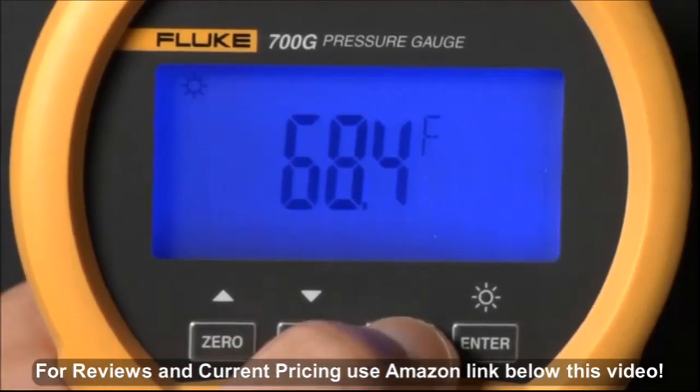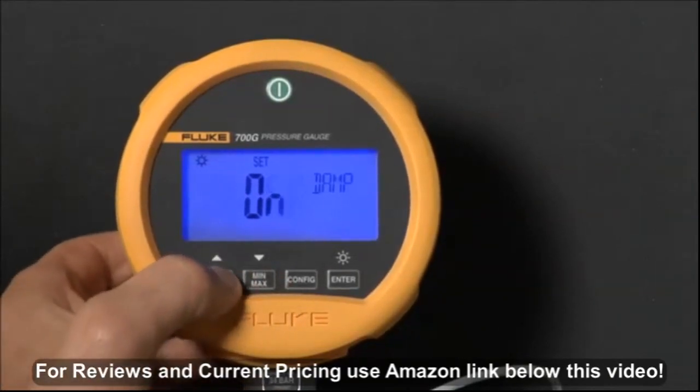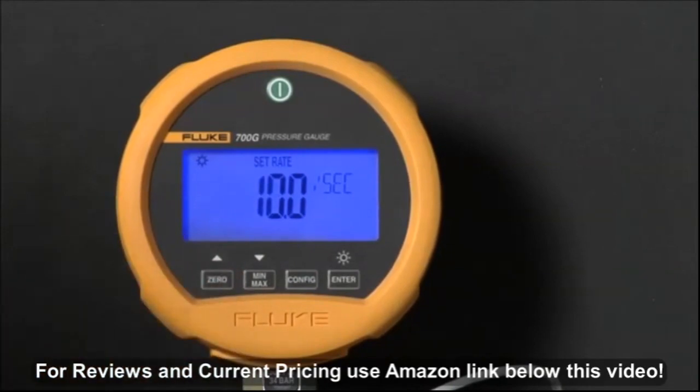Press Config again to see the dampening setting. Dampening smooths or averages readings from pulsating pressure sources. Up and down arrows turn dampening on or off. Press Config again to change the reading rate. Up and down arrows can change the reading rate from 10 readings per second to 1 reading every 2 seconds.